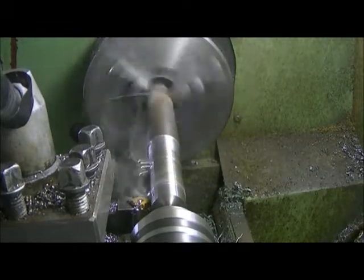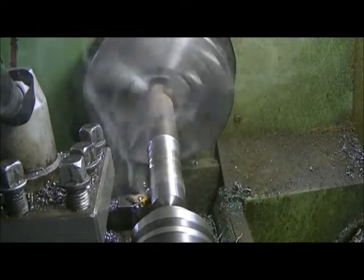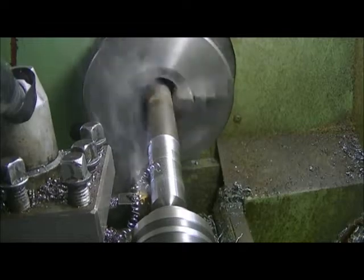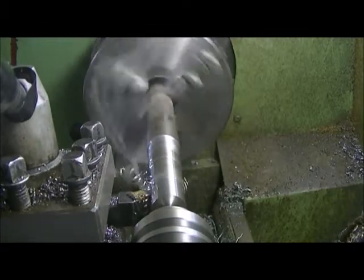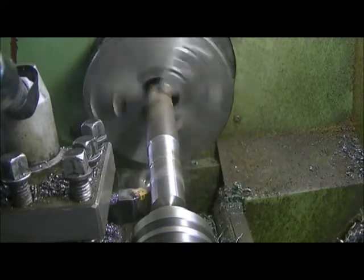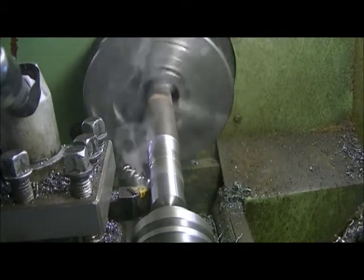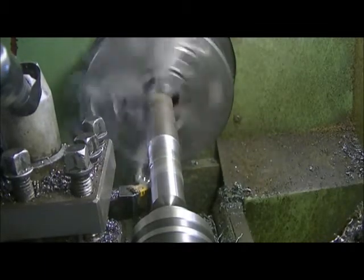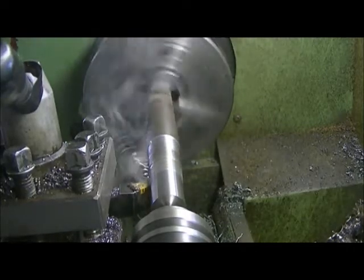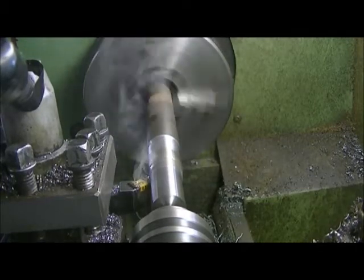Most machinists would be bored with this. They would take it down lots at once. I just like to take my time at it. I enjoy doing it, I guess. I'm in no rush to get it over with, so I just chew away at it. Actually, I think I've done it both ways, and you get a nicer job this way. Your cutter isn't chattering or gouging or anything, it's just taking a piece off.